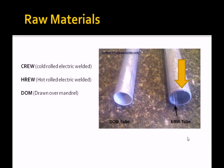To get a good mixture of weight and strength, the wall strength can be increased in the center post and backbone, while keeping the same outer diameter tubing yet with a thinner wall for the rest of the frame. You could use 1.25-inch diameter with a thickness of 0.095-inch for everything but the center post and backbone, then a 0.120-inch wall thickness for those parts. The larger tubes of 1.5-inch diameter will make for a heavy chassis, but the larger tubing is easier to cut and weld for less experienced fabricators.